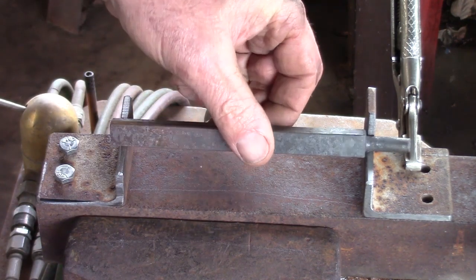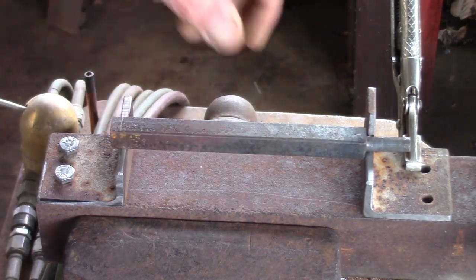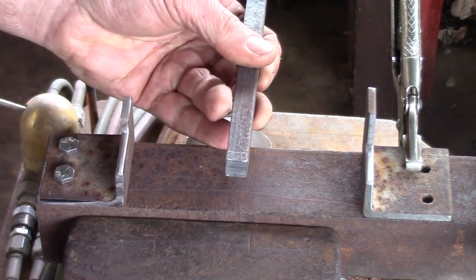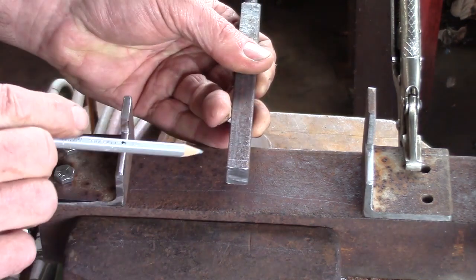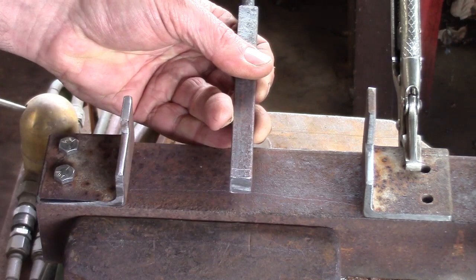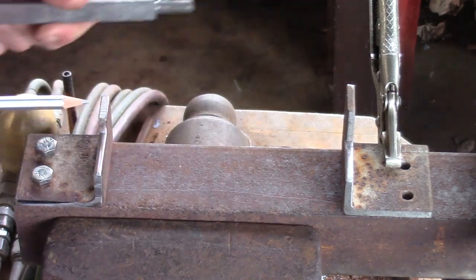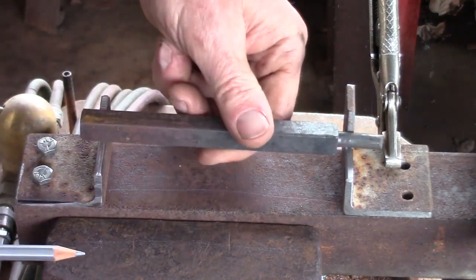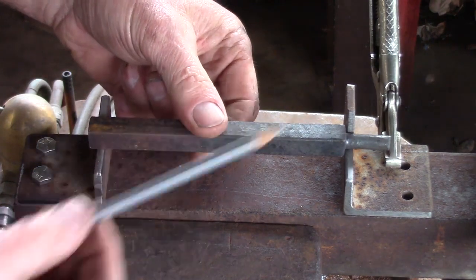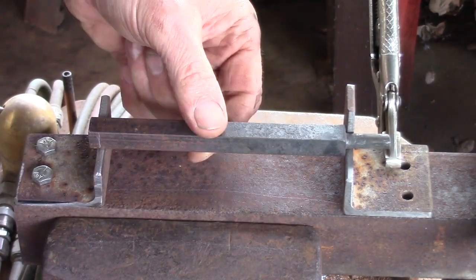Bar goes on, this end is hot. I come with my hand hammer and just give it a bang, turn it over 180 degrees so I've got a mark in here, then turn it over and bang again — so I've got a mark on either side of the bar. That will then go into my butcher dies on my blacksmith's helper or guillotine, and I'll be able to isolate the material for the tenon. The anvil side has got a tab sawn down so I can hit it with my hand hammer without interference, while the other side is left up so it will capture one shoulder of the tenon and hold it in place.